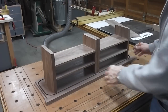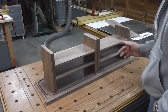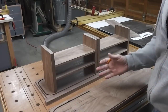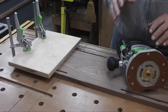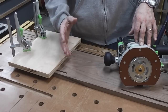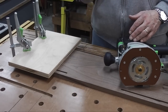Now you can see how this is going to go together a little bit more. These are going to be centered, about an eighth of an inch back, so the tambour can roll around. I do want to make a divider on top here — I've marked the center line for these. There's going to be another stop dado along here, and I need to make the same stop dado along the top here, and I will do that at the router table. I'm getting ready to cut the stop grooves or stop dados in the subtop. I've got the same three-eighths-inch bit in my router, a template collar or guide bushing on here. I've got a spacer block, and I'm 99.9% sure my math is correct, so if I put it here with starting and stopping points for the router, this is all going to work out and that divider is going to be perfectly perpendicular in there.